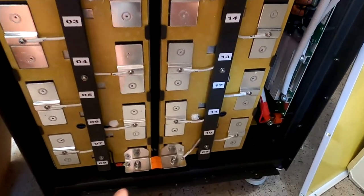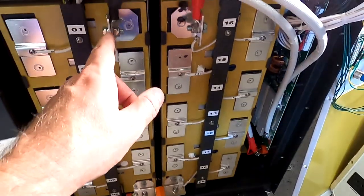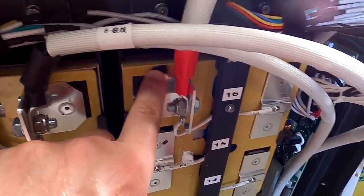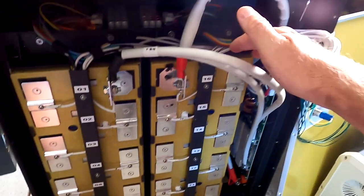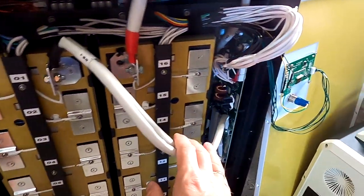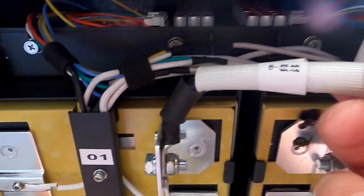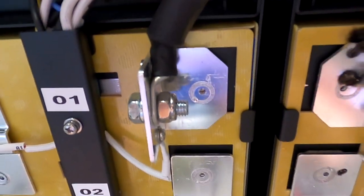And we can also take off this link here to have the possibility, if one of your cables slips, that it actually makes a short as I did yesterday with the balance cables here. But in this case, I would say the negative cable is already halfway out. It's connected here to the BMS with two screws and goes up here. And both cables are connected to a ring lug connected here to the main negative of the battery.